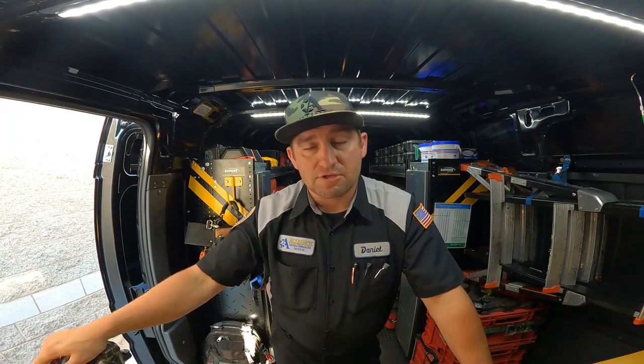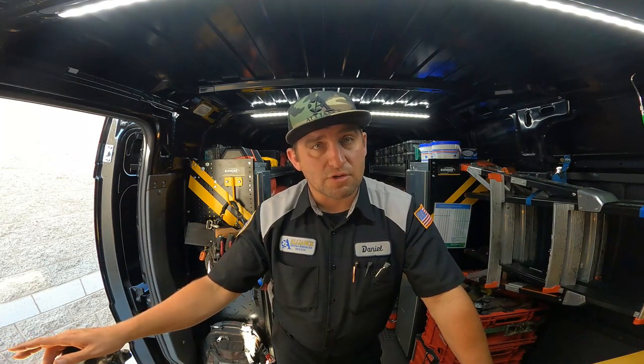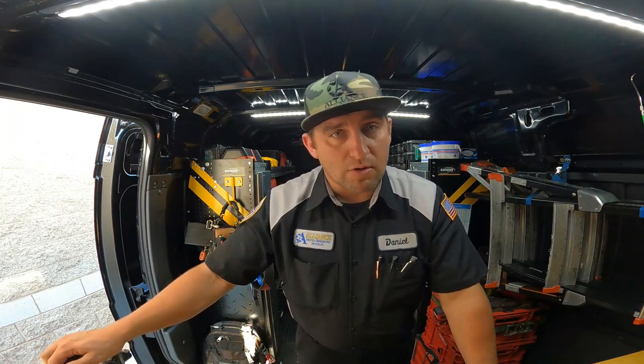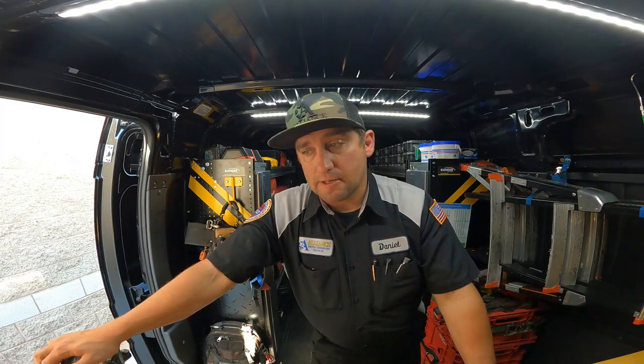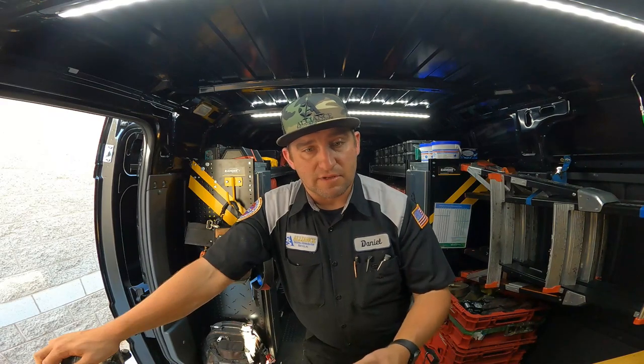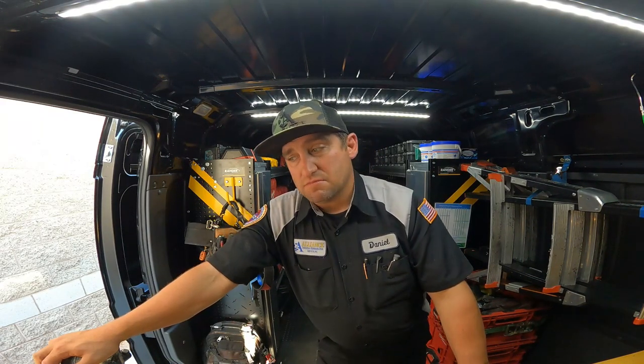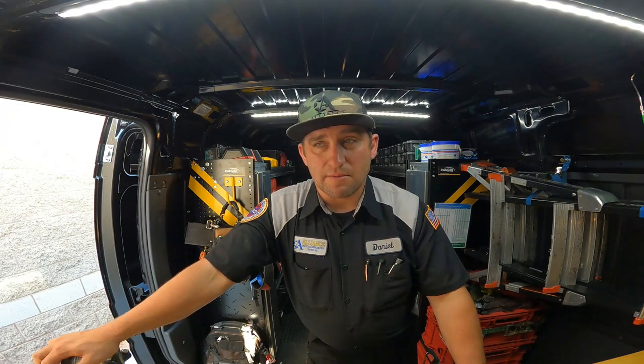Yeah, it looks good. Make sure you check the drains on these things. Make sure the valves are opening. Make sure the water fill solenoid's working. Make sure the float works. And you can set timers on that so you can delay fill, delay drain, all that stuff. And they run well. I don't really have to work on that much.